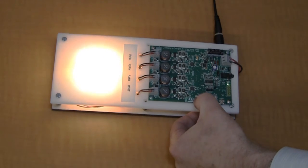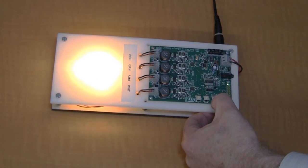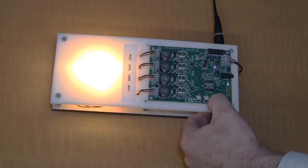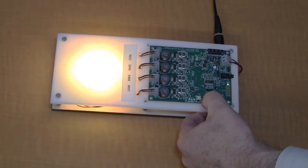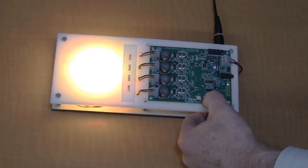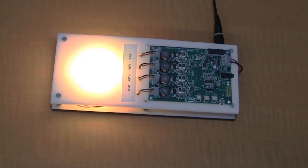I'm going to take the white and take it down. Amber's up pretty well. And if I go through to the next one, I can look at the amber and the green — let's take the green up a little bit. And obviously I can take the red up a little bit as well. What this is implementing is a state-controlled PWM machine for each of those four colors, all done with a regulation loop that's regulating the current through the LEDs.